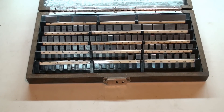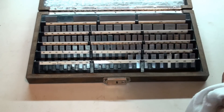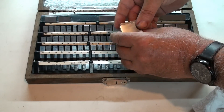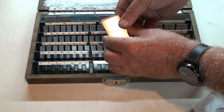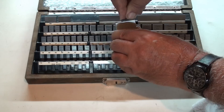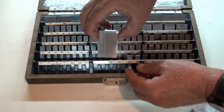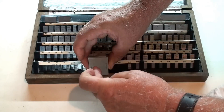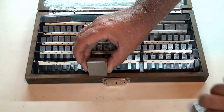That's amazing. Why would you ever need that sort of accuracy? What you do is you build up the blocks. So if you wanted a measurement of two inches plus point one-four-four — one hundred and forty-four thousandths of an inch — you would put them together. They're so finely polished that when you slide them, they actually stick together. So now you would get your height gauge, have this on your table, measure against it. Use this as the gauge.